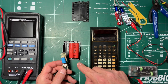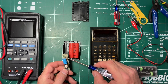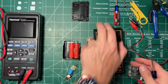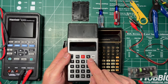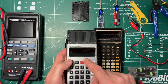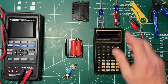It wasn't clear to me what was going on. Was this a step-up power supply? This is the power in, this is the power out. Was it to give you three volts, five volts, six volts, nine volts? Not sure. The Digimatic has a step-up power supply in it, and it steps up the nickel cadmium batteries to about eight and a half volts. There's a potentiometer that sets the voltage, and I turned it up because I wanted the display a little brighter, and I assumed it was designed to run at nine volts-ish.